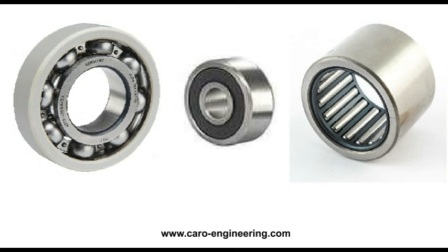Open bearings collect dust and grit, and soon the friction increases. Ball bearings have lower load ratings than bushings. Small diameter ball bearings can only handle low loads. The load rating increases with the diameter. If there is not enough room for larger diameter bearings, increase the number of hinges.